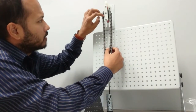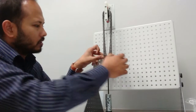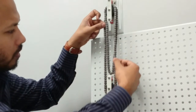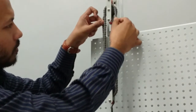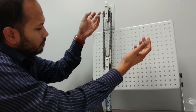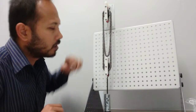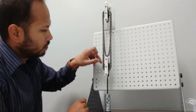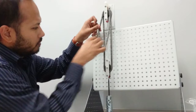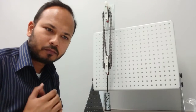The next question is how we obtain power using this system and how it is self-sustained. This small difference in gear teeth gives us the mechanical advantage. It is self-sustained because one part of the chain is pulling the bigger pulley in one direction, and the other cord is pulling the smaller pulley in the other direction — they are balanced. That's why in every position it is self-sustained and the load doesn't fall down. If the two pulleys were the same size, we would not be able to raise or lower the load, but even a slight size difference allows us to do so.